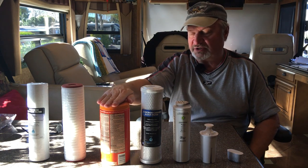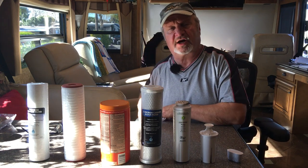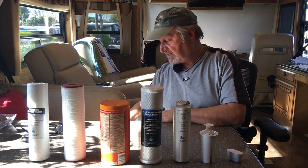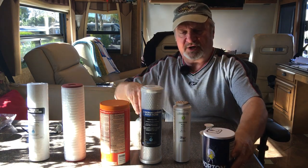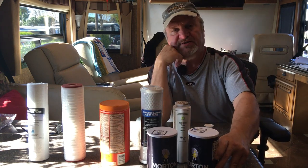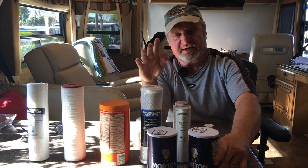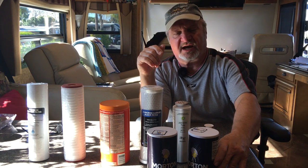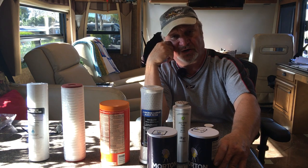The water softener does require some maintenance. I'm probably going to try to do some video on that today. It's a fairly straightforward process. You put two jugs of this table salt in periodically, and it depends on the hardness of the water, but it's turning out to be about 3 months. Every 3 months I have to do it. It's maybe an hour job because you have to fool around with backwashing and things. Probably the biggest problem is getting rid of the water.